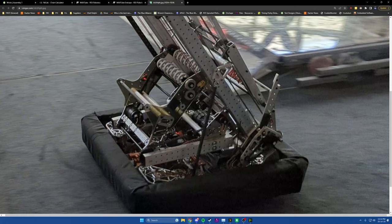One of the things this also gives me a chance to talk about is something that anybody who's ever cloned a mechanism will know. We're going to estimate some of these dimensions — we're probably not going to make something exactly the same dimensions. One of the primary ways to estimate dimensions when copying something is, especially when a team is nicely giving you a whole photo like this, you can look and count all the holes. If we count this up on this lengthwise piece: one, two, three, four, five, six, seven, eight, nine, ten, eleven, twelve, thirteen, fourteen, fifteen, sixteen. So this piece is probably 17 or 18 inches long.